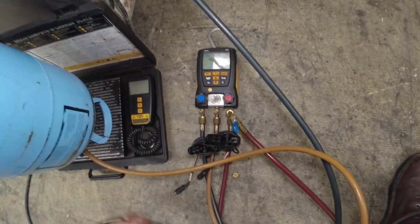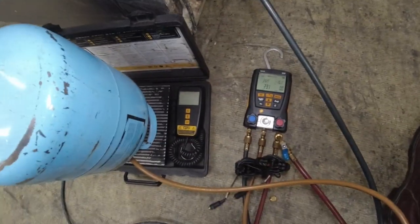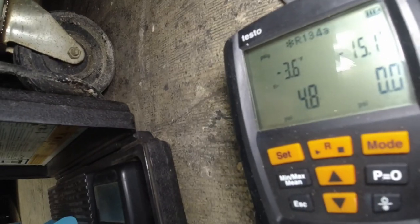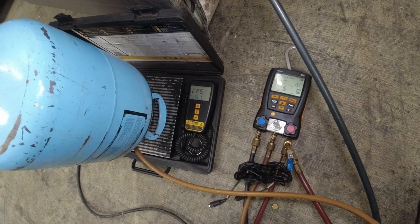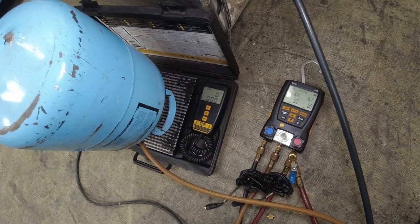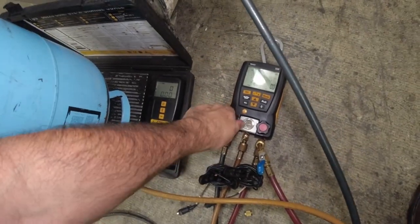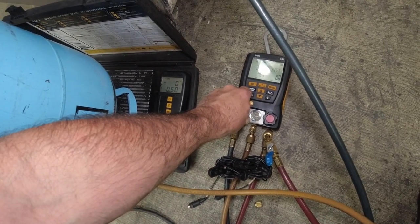We just charged it back up to spec. Those cap tubes are probably starting to get filled up - look at that suction pressure dropping. We're going to have to add something to get it going. This thing's been running into a negative so much it's starting to bake the oil. We're going to have to overcharge it if they want to at least get it running so they can operate. I'm going to recommend we dump the oil out of the compressor because I guarantee it's shot. There it goes into a negative - I don't necessarily recommend adding extra like this, but there's not a whole lot of options other than shut it down.